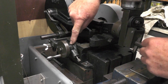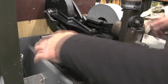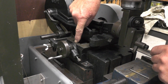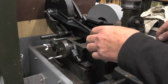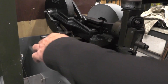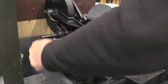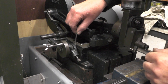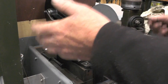Mine's quite worn but mine still works okay. But there's another little reason that might be overlooked, and that's this: there's a little friction screw that acts on the lead screw here. If that's not quite set right you'll get the same effect. Obviously you can't have it too tight or you won't be able to turn it manually, so it has to be set right - mine's a little bit temperamental, it has to be set at the exact position best for the machine.